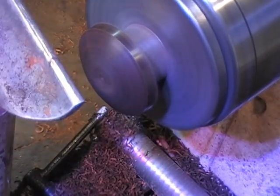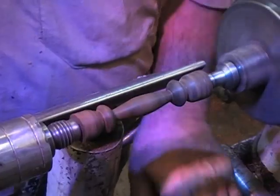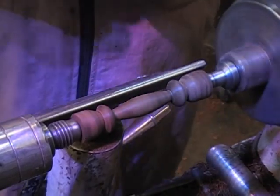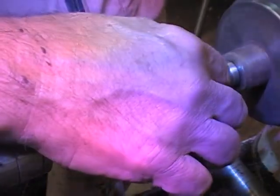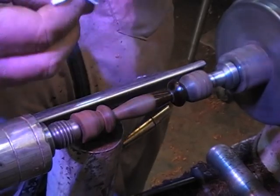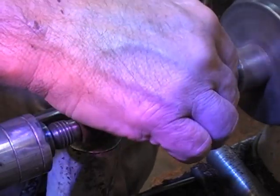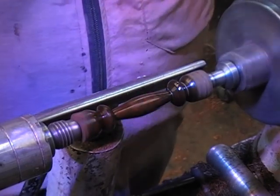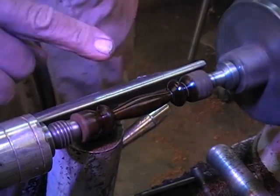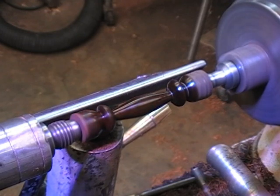We're in really good shape. We're going to sand before we do the next step, and once again after sanding I'm going to go ahead and put a little pre-coat of CA on this. That's going to give me a little bit of something to start with on the base. I need a tenon on each end of this, and that tenon is going to be based upon the quarter inch that I just left allowed in the bottom of that other piece.